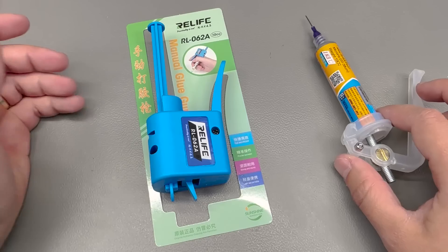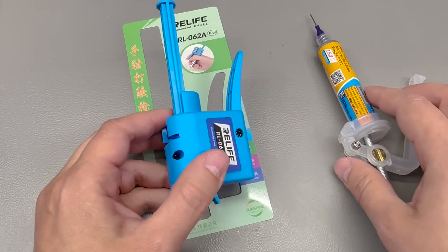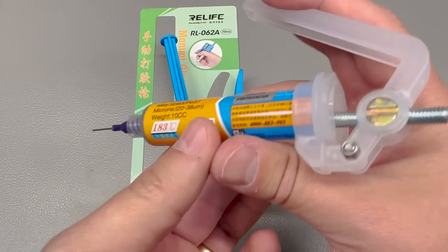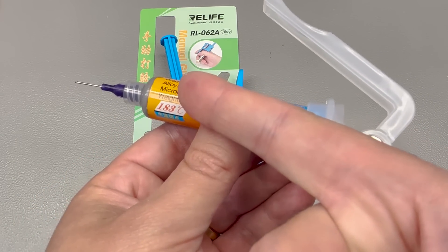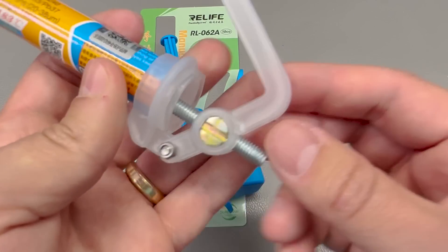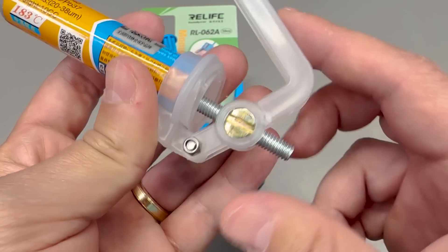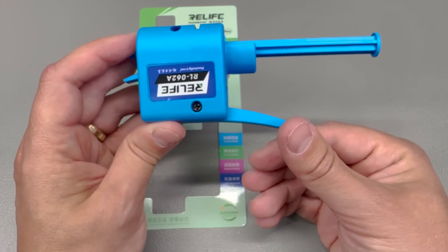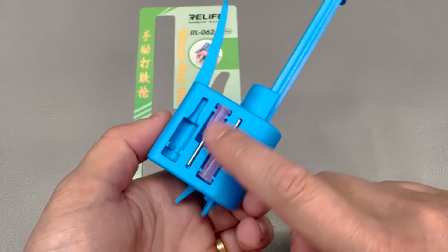Next up here is a new model of a syringe booster. I've been using a bunch of different models and this one has been my favorite for solder paste syringes because it provides a lever to amplify the force and is fairly cheap. But at some point the paste becomes more viscous as it dries up, and the poor little plastic handle just can't take the force and starts to crack at the weak point, so sooner or later it fails. This newer model from Relife seems to be a lot more sturdy.